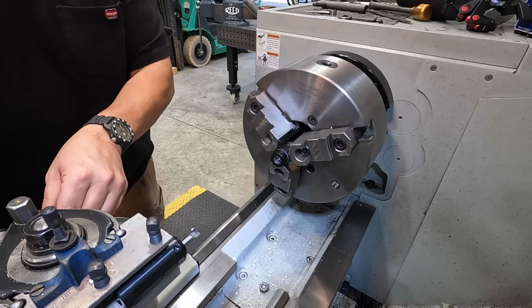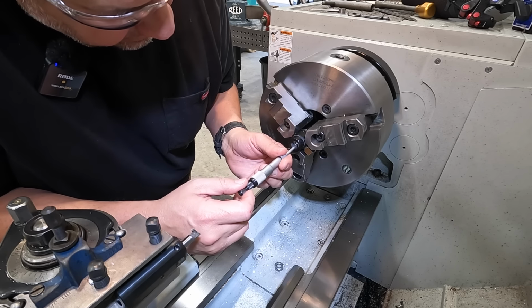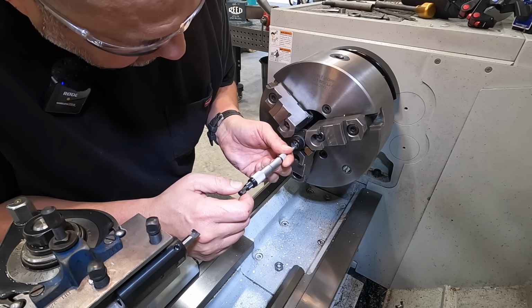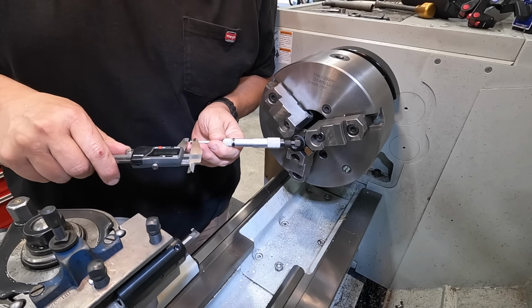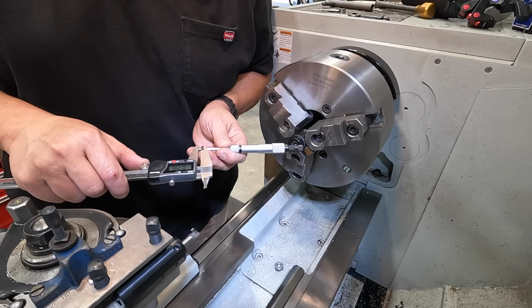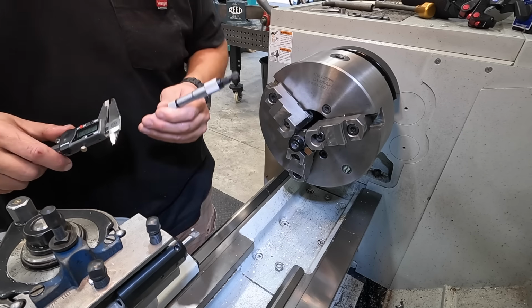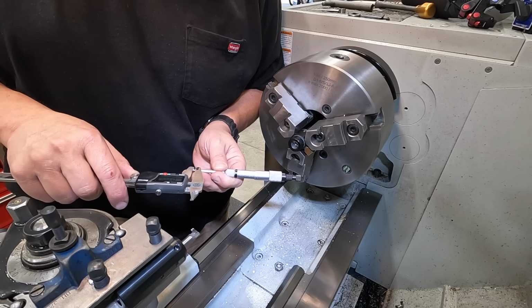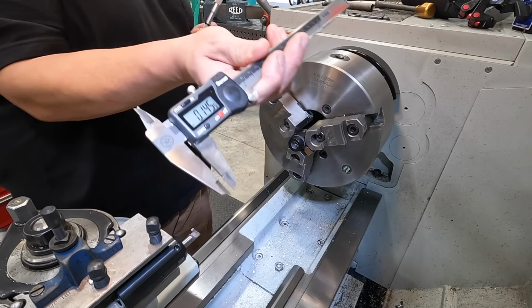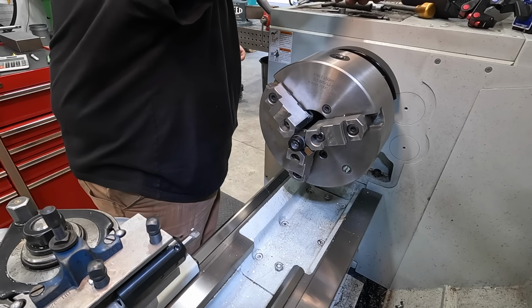I just want to go ahead and verify these measurements on the second gland that we just cut. Perfect. I actually went, instead of 12 thousandths like the first one, 15 thousandths on that one. I realized our plus tolerance was 10 thousandths. So I'm getting 144 to 145 on our width right there. Target was 138 plus 10 minus zero.